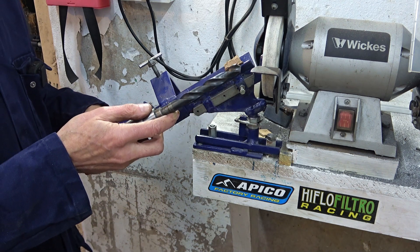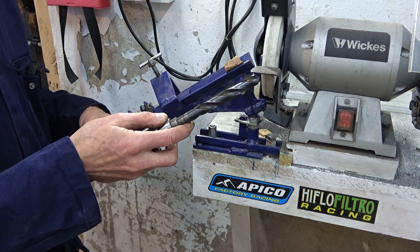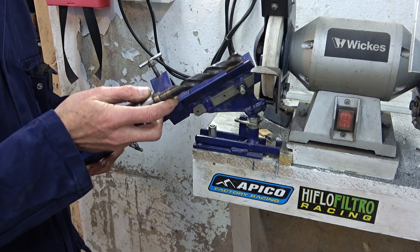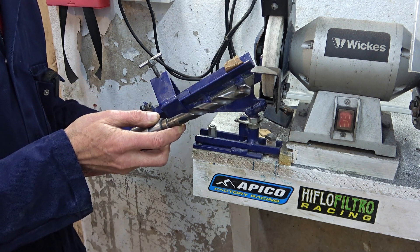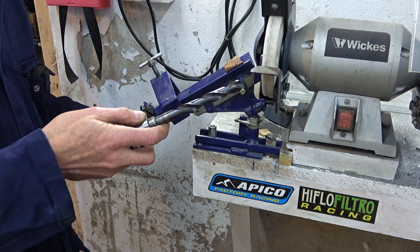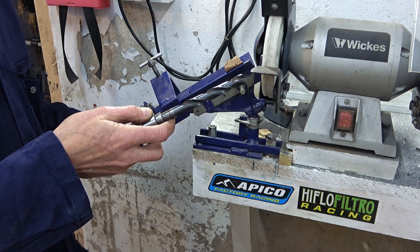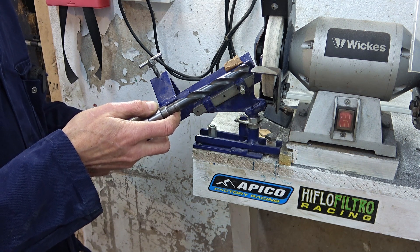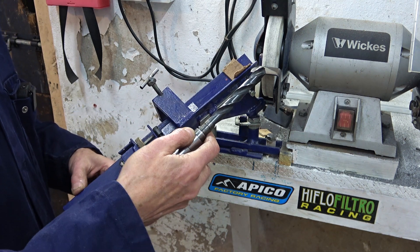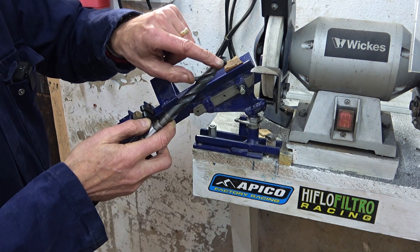The cut starts at that angle. I hope you can see that — we're not at 90 degrees to the wheel; we're starting at about 7 degrees off, 83 degrees if you like. And then we swivel, and it cuts the face of the drill point.